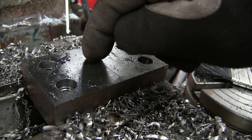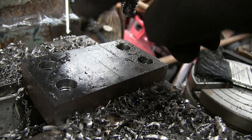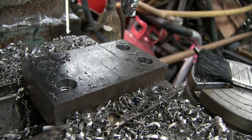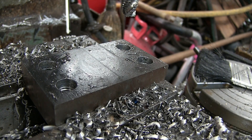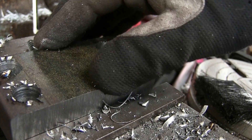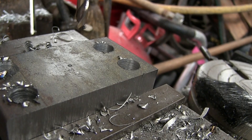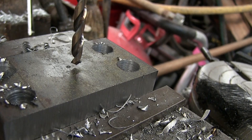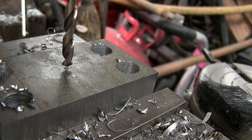One thing I noticed I forgot to do was drill, while I had it in there, a through hole. That's how you're going to eject the plug - the slug - after you broach it. You need somewhere for the chip to go. We'll drill a hole right in the center. Now we've got the top plate in again - always time to do it right the second time. We're going to punch a little quarter-inch pocket in there for style.